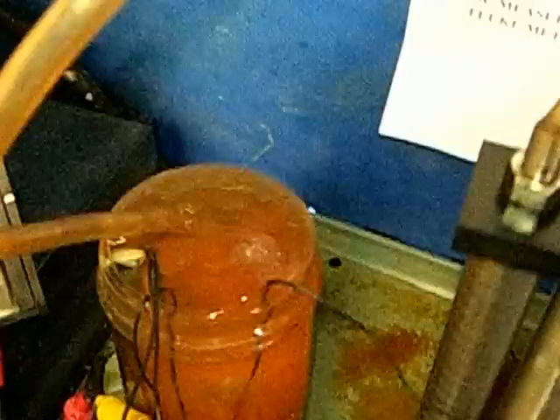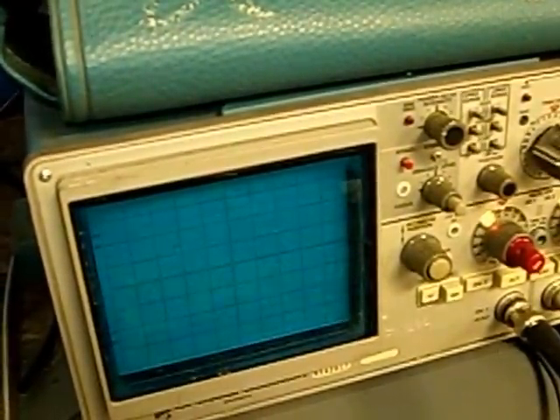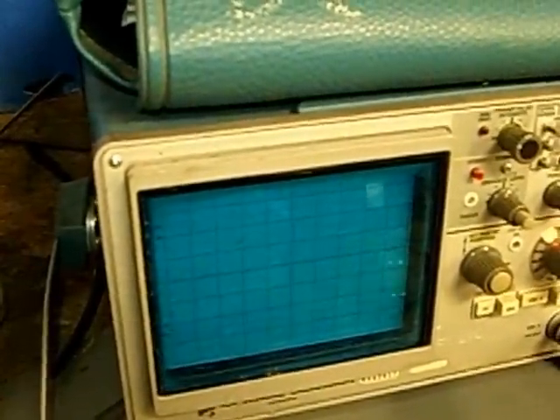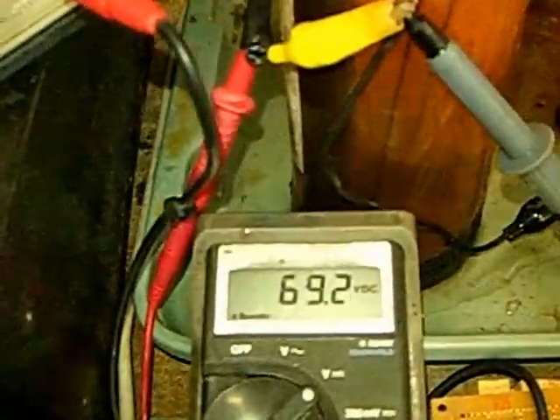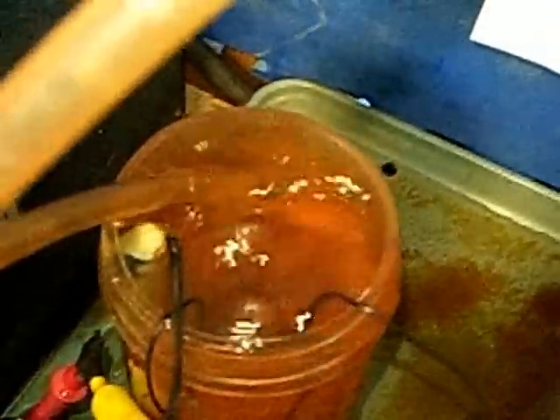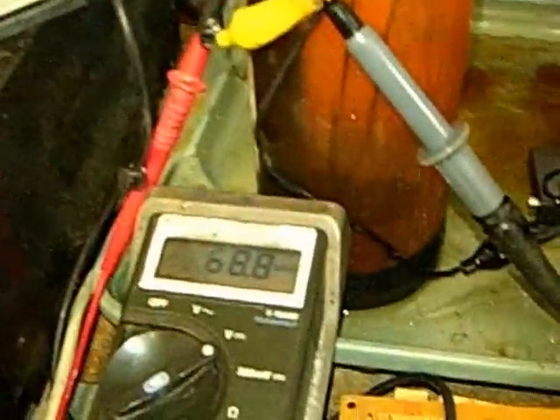You can see we're doing an extensive amount of hydrogen now. I'm going to go ahead and bring the pulse closer. We're about 68 volts driving the cell and we are making a large amount of hydrogen gas — and this is hydrogen gas. I like to do this just to kind of prove it. You can see the gas is being formed at 68 volts.